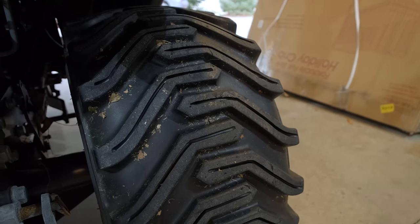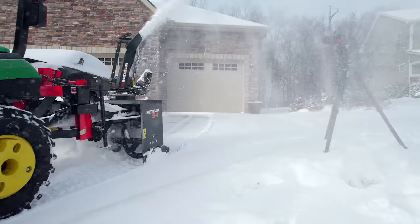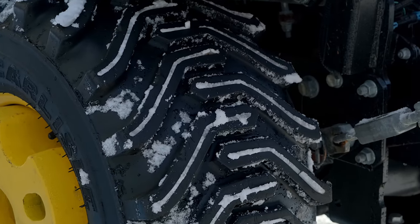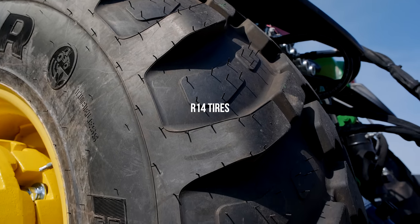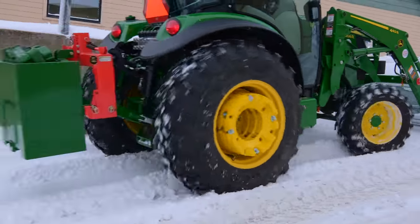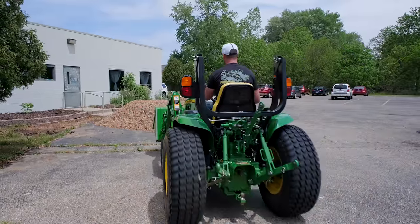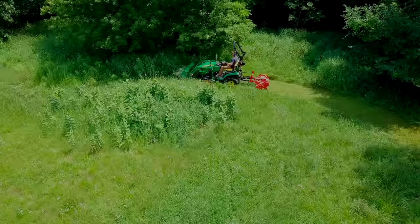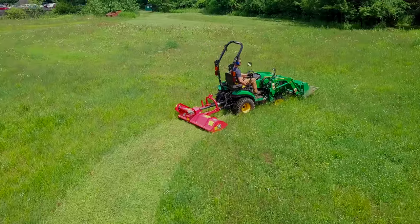I have a buddy down the road who's getting delivery of his new Kubota L6060 anniversary edition, and I encouraged him to check out what tire options are available. Not only are tires very expensive to replace, but certain tread patterns — if you want to go from a turf tire to an R4, R14, ag, or whatever — you may need a new wheel as well. Not every wheel is compatible with every tread pattern. On a big three or four series compact tractor, that could be two grand or more if you need to change both wheels and tires.